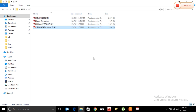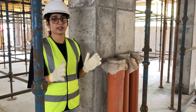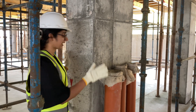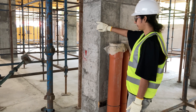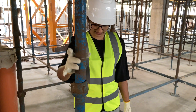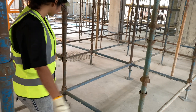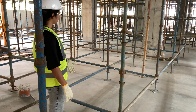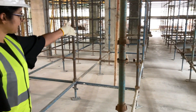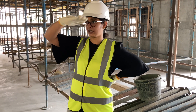Now we go to site to see how to erect the system. From the drawing, we find the dimensions and alignments. We take a column as a reference structure, mark the X and Y dimensions, and fix the first standard. After placing this first standard, we use ledgers to make it rigid and place four standards to form a grid. We repeat this in both X and Y directions across the full area, using a line-duty string to keep them aligned. After making the grid, we put U-jacks, level them, then install the primary beam, secondary beam, and plywood.